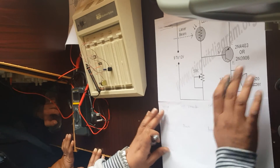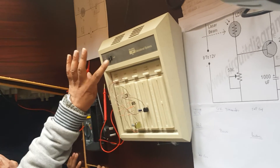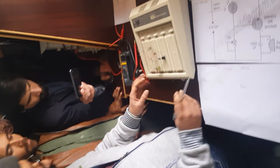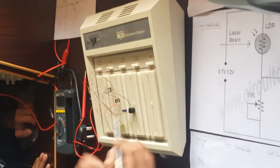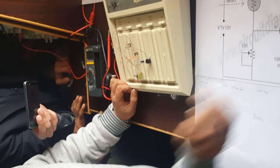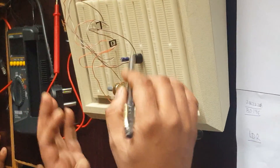Now let's look at the physical circuit. Turn off the power first. The plus voltage goes into a voltage regulator for the security of the circuit so it won't blow any components. 6 volts comes out of the voltage regulator and connects to the positive of the LDR. The negative of the LDR is connected to the base of the transistor.